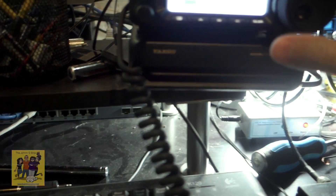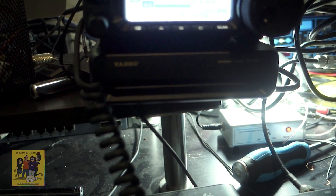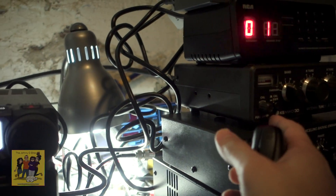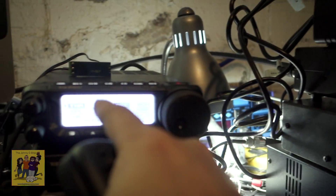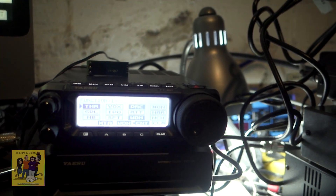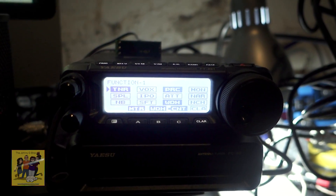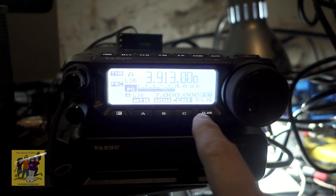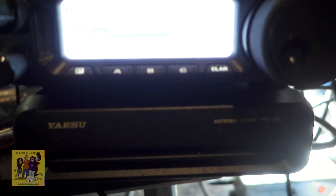Let's see what we hear — we hear nothing. Let's see what we can do here, see if we're even in tune. I've got my 40 meter down to where it's somewhat obtainable. I use the tuner in here just to get back and forth without having to tune directly for that area. I think I'm pretty close anyway, so this is verified. Now let's go out here — and this was the biggie. I wasn't able to pump out 100 watts before, so let's try it.